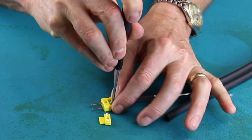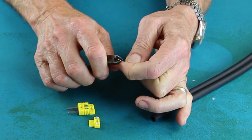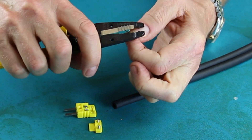If the wires are damaged, loosen the terminal plate, then remove the wires and any fragments from underneath. For the older connector, loosen the two individual terminal screws, remove the wires and any fragments from under the screws, and then proceed the same way. Cut the two wires so both are the same length. Note that you may have to strip back a small amount of the brown outer casing — just be careful not to nick either of the two thermocouple wires within. Next, strip approximately one quarter to three eighths of an inch of the insulation from each thermocouple wire. Then install the wires under the terminal plates and tighten the screws. Older connectors will have two screw terminals instead of the single terminal plate, and a pair of round nose pliers will definitely help in getting a clean wire curve for wrapping around the individual terminal screws.